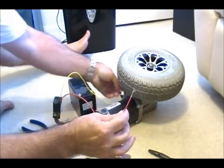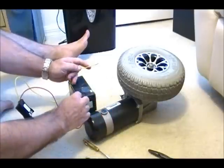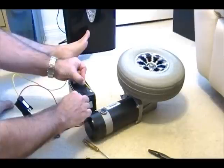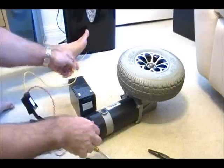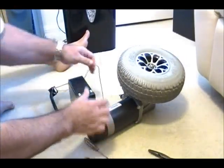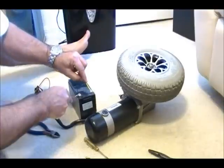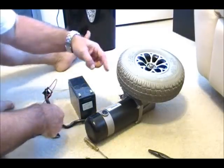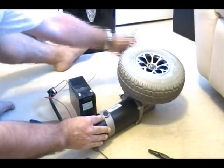Even if it's going to be slow, I just want to see some kind of motion. This is the positive, this is the negative — red is the positive. And hopefully it doesn't blow up. There you go — the motor works in this direction, and in that direction. If by any chance you had this thing disengaged, the motor turns — you can hear it turning — but the worm gear that's in there, that drives this thing, is disengaged.